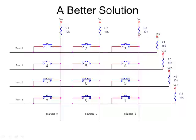We have pull-up resistors so that if everything is unconnected, the bits read a one. There are no connections between the rows and columns at the crossings — these are not junctions. The only time you get a connection between a row and a column is if you press a key.